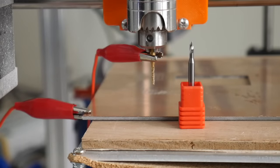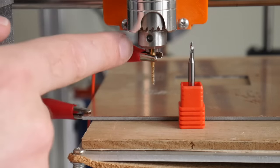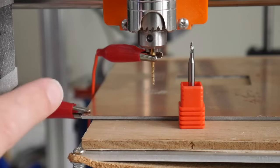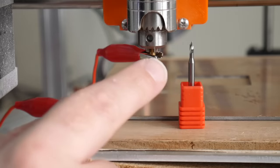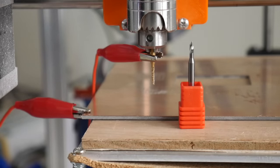And now that we can home our Z-axis using the exact cutting bit attached to the Dremel onto the top of the work surface, we can take advantage of Marlin's auto bed leveling. We only need to auto bed level when we have the V-bit attached to the Dremel. As it'll only be going down 0.1mm, we need to ensure that that has the same distance throughout the entire milling operation. But when it comes to, you know, drilling holes or cutting out the board, it's not important,